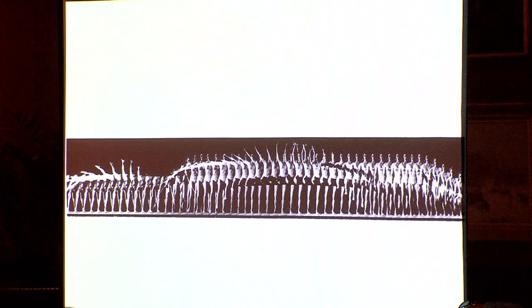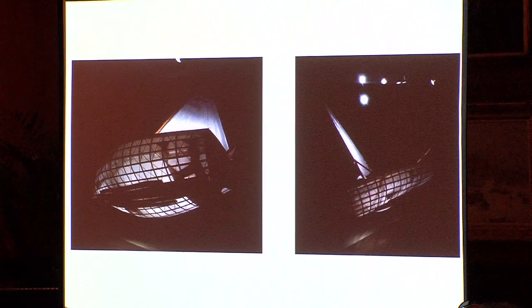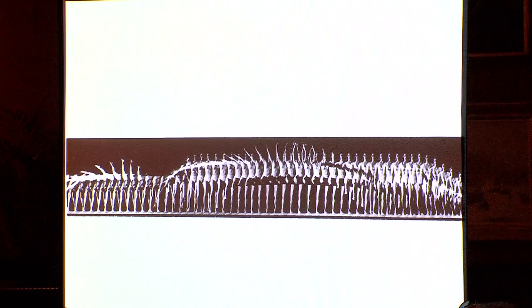In order to build a boat, like, I don't know if I can go to a good image of this thing. All right. Well, if you break up the hull of a boat into sections, there's the front of the boat, let's say halfway through the boat, and the end of the boat, just to make it simple. If you made a cross section in the center of the boat, that shape would have a certain geometry or a certain contour. If you were to connect the geometries from the front of the boat, the middle of the boat, and the end of the boat, that translation of geometry, that would be lofting. It would just be the translation of those contours to each other.